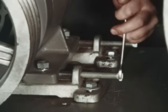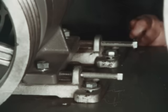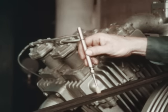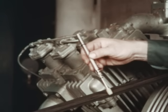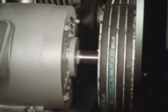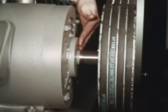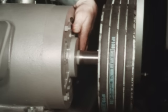Due to the nature of the materials used in belt construction and their initial stretching characteristics, it may be necessary to re-tension the new belts after a day or so of operation. Another method of checking V-belt tension is with a tensiometer. Always follow the manufacturer's guides and tables when using this method. Belts that are over-tensioned can be a problem. Tight running belts cause the bearings to overheat as a result of too much strain. To correct overloaded bearings, loosen the belts and apply the correct tension.